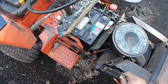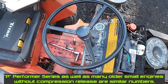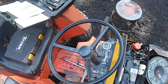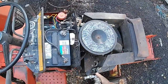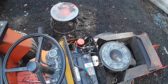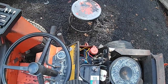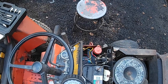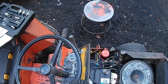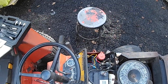So kind of rule of thumb on these Onan B-Series — the manual does have specs but it's really a little bit left up to opinion in how the engine actually runs: if you're burning oil, if you feel like you're low on power or not. They say anything under 80 pounds roughly should be rebuilt. We've had them in here running at 60-65 pounds — it might smoke a little bit, might start a little bit hard, but they actually have plenty of power and do alright. New, I can't find specs but I'm going to guess they were 125-150 because we've had them in at 130 pounds plus. Anything above 90 is definitely good, anything above 100 is really good. We've had them run at 65 pounds and you can keep on going until you feel like it's using too much oil or you've got no power.